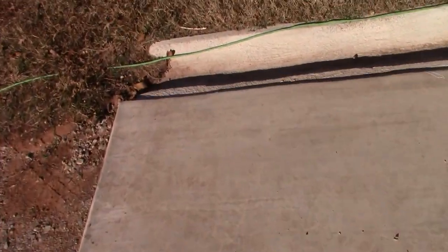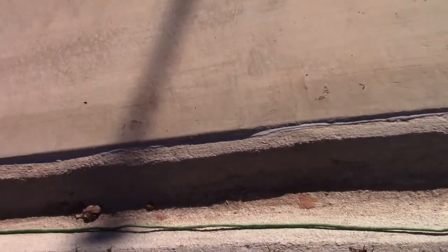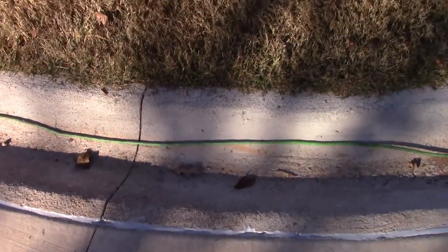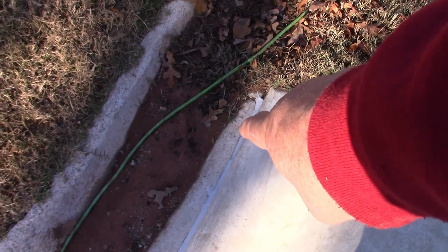Let's go back and check it. You can see it looks really good. That excess stuff I can just scrape off with a razor or let it dry. I may put some more right there in that little spot. Everywhere else looks good. You can even see where I touched up the other spots. Right there I may need to put some more too — those were the large deep cracks so let's get them now. The longer it sits, the more the sealant settles down into the crack.